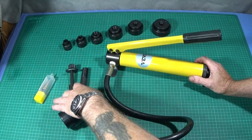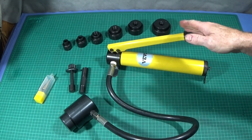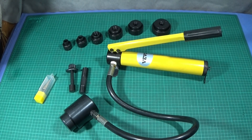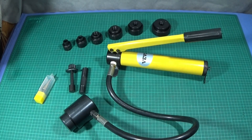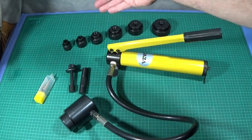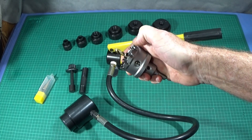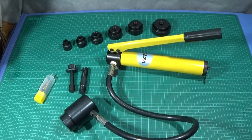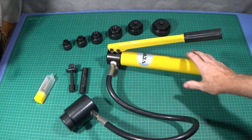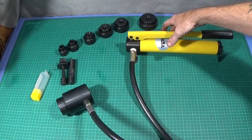It is very simple and easy to use — I was really impressed when I first tested it, and the ease of pumping to punch the hole through a metal plate. In the past I used to use carbide-tipped hole saws for drilling large diameter holes, but these tend to blunt and the carbide tips on the saw face tend to fall off. Having one of these cuts out the need for those hole saws, which are very expensive. These knockout punches are much safer and dead easy to use.